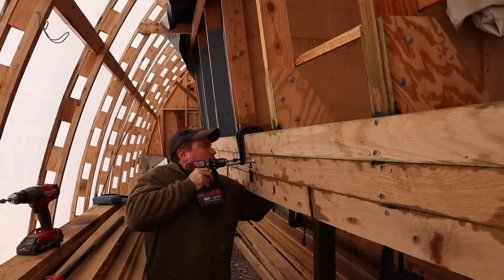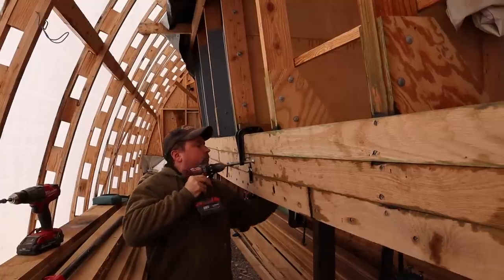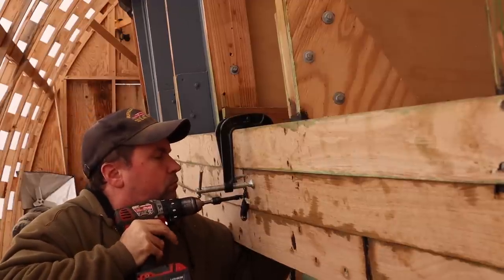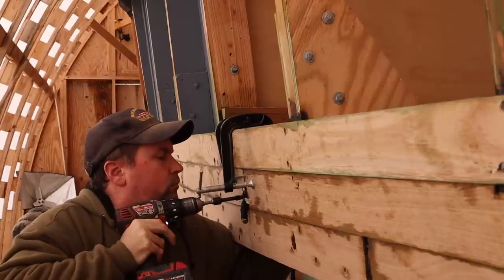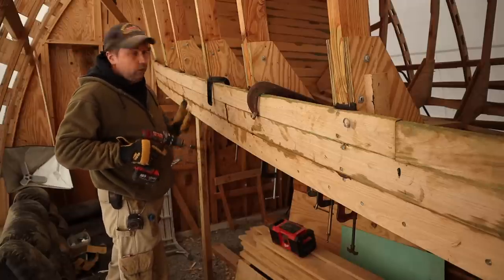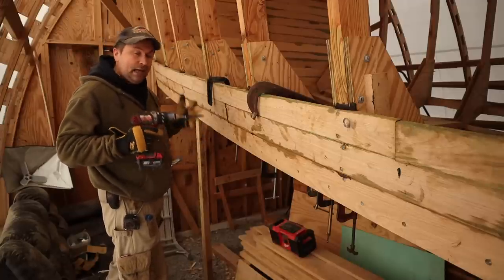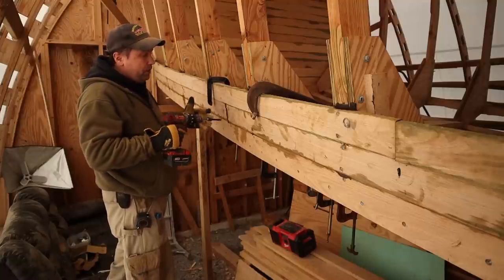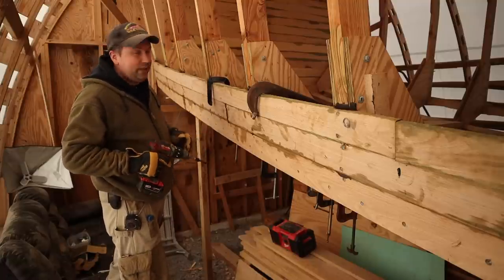They'll just lay smoothly to the substrate here and I won't have to use as many of those metal washers on the plywood to try to pull things tightly together. This just eases our operation down the road. However, it's a good technique to know if you're planning on building a wooden boat, you're not locked into having to scarf all your planks. You can do a butt block, which has a long proven history and is very easy to do.